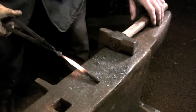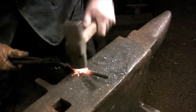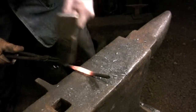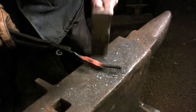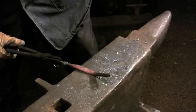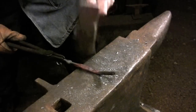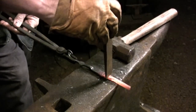The final offset defines the transition between the pivot area of the bar to the large flat end of the bar that actually hooks into the keeper. I usually forge this part a lot longer than I need to and then I cut it after the whole thing is assembled. To find the location for this offset I just compare the forging to the pattern of the back plate that I'm working with.